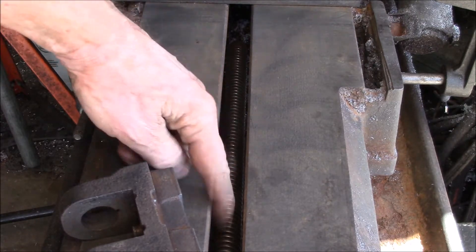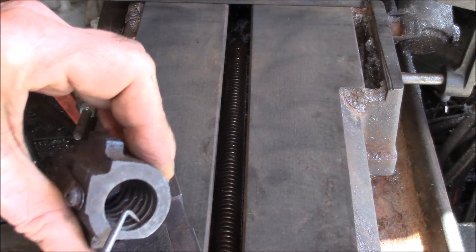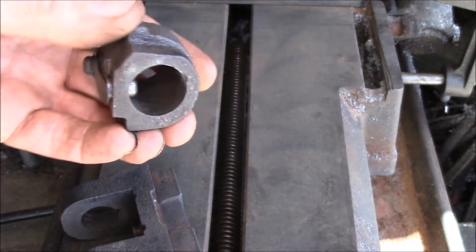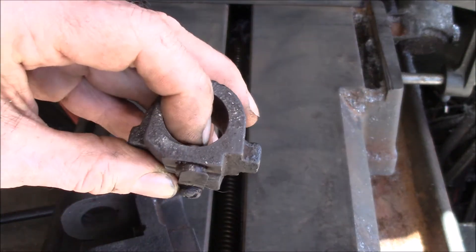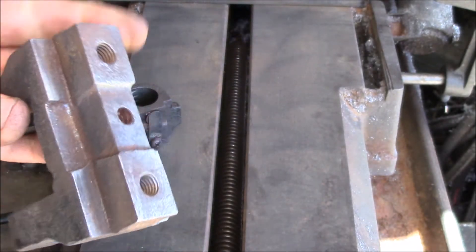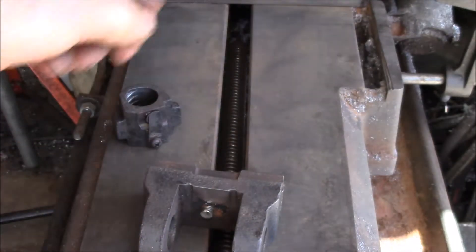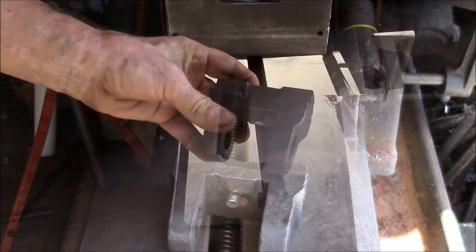What happens is cutting oil and chips get in on the lead screw and then get packed into these threads. What you have to do is take this off and run a little pick through there to get all the threads cleaned out down to the bottom. Also this little pin gets kind of tight in there, so I wire-brush that clean and put a little bit of grease in it. I chased all the threads here because they get pretty beat up — you use water-based cutting oil on this saw, so you get a lot of rust since this is all cast iron.